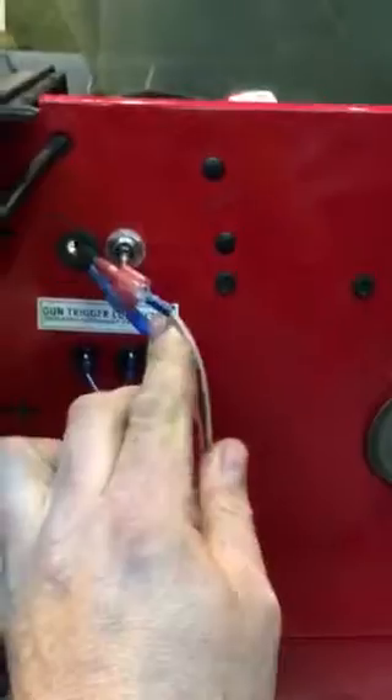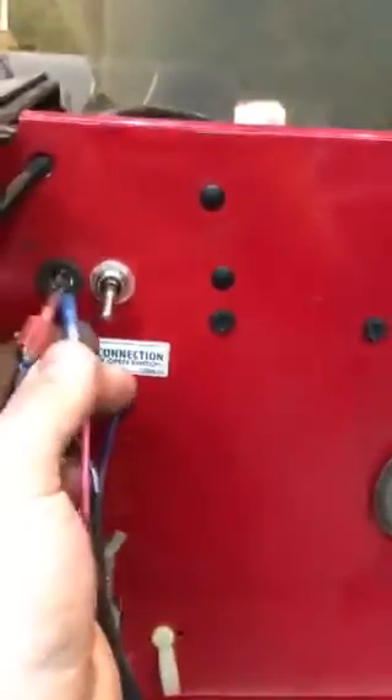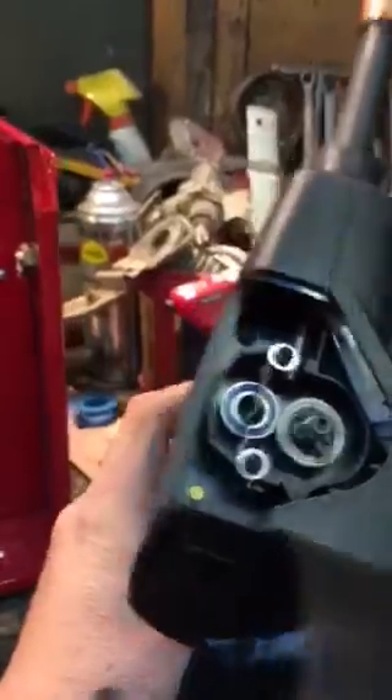When I put the switch here, with these connected I put a male and a female so I can't mix it up later on. I used the insulated ones so they can't touch later on. Basically plug these in and pull it out. You'll need to make sure you have the option of the gas valve — if it doesn't have it, that's a kit you can add on. You just add two wires here with a circuit board. Mine had it in it. Now I switched it — it runs it in the MIG load. If you have a MIG pack 10, there are a bunch of other models that are similar, you can run a magnum 100 SG spool gun on this. You'll just have to do a little bit of wiring. There's a gray and a white wire here.